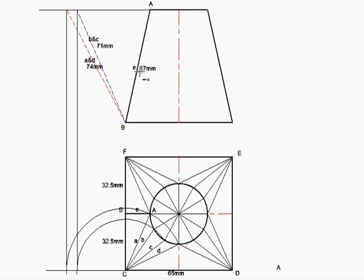You can see I've labeled my true lengths here, but you might ask, why have I only drawn true lengths? Take note that the length of line A or fold A is the same size as line or fold D. The same happens with B. B that I've got here is the same length, if you follow that circle and do the construction, as C. Therefore, A and D have the same length. A and D is 74. And B and C have the same true length of 71.